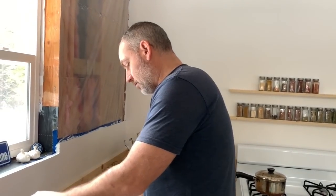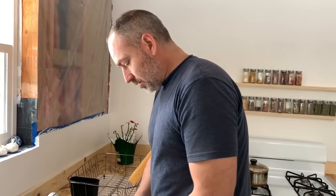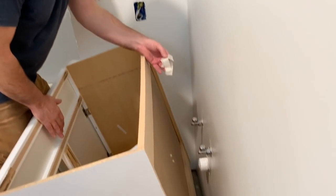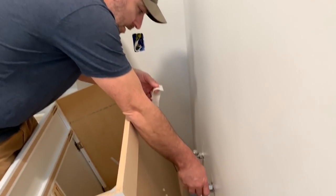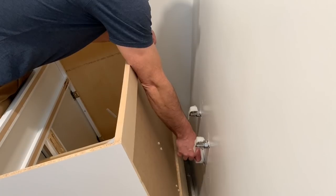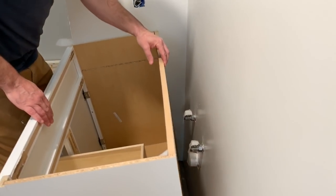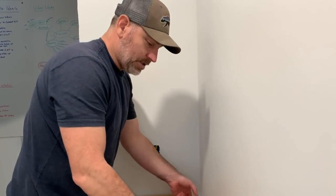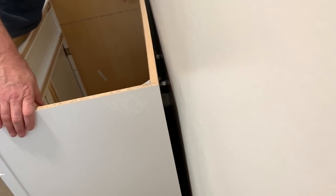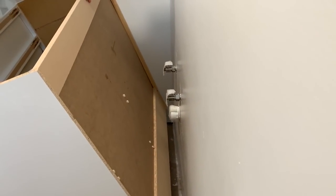Marty's got a master plan. So we need to see where the valves are going to come through so we can drill the holes. Some people have said different things to find out where boxes are in the back of sheetrock — like lipstick was one of them. That's a really good idea, but we don't have any lipstick. So I got an idea here with wet paper towels. These are our valves that I need to drill holes for. I'm just going to put this on there, push this back up against them. We've got wet spots — bam and bam.